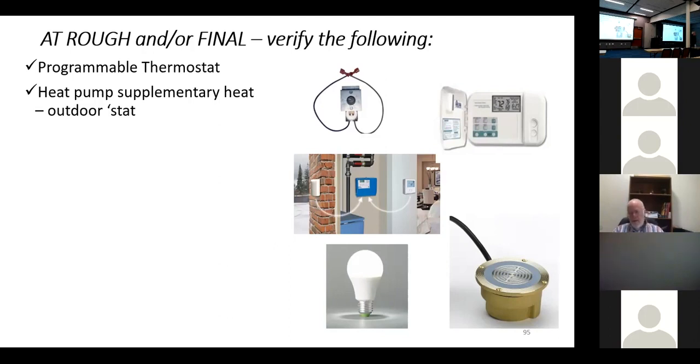Have you seen it? I haven't. Is there a moisture issue with that? Well, it's pretty easy to control. Is that a big thing? How are you controlling it? We're in Utah. So they just got a dehumidifier system, right? They don't need a dehumidifier. You just do less evap and mix in some dry outside air. Our air is so dry, we just don't need it.